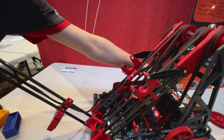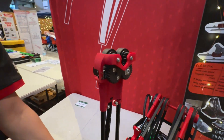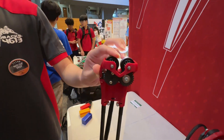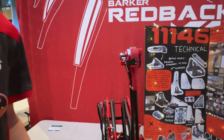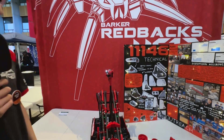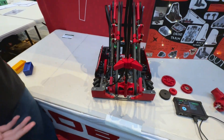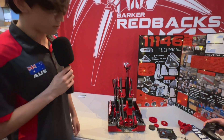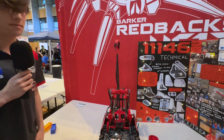For intake, with the arm we needed the load to be really light, so the goal was to make it as small and as light as possible. The whole package just weighs 75 grams including the servo. It's a double roller active intake design and it allows us to have that touch-it-own-it mindset. We've added a color sensor on the side so it can automate processes in autonomous and also have that option for teleop. To keep it light and small we've decided to have a separate system for specimens — it's entirely passive, powered only by rubber bands contained within the middle. The driver would just run into the wall and it'll intake, then push one button and it'll go up to outtake. When he pulls down, the elastics pull back and the specimen can be released.